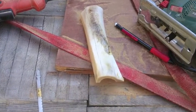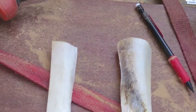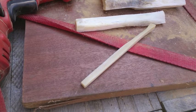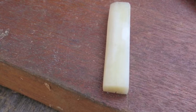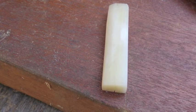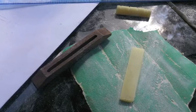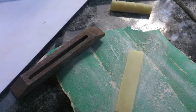While that was going I started some bone work. We had some marrow bones that I'd put in the dishwasher to wash off the excess meat, and trimmed it using the hand jigsaw. It's actually really nice material to use — it smells awful but it works beautifully. A bit of advice: cut much longer than you need so you have a handle, shape the end, then just cut it off. This is going to be the nut at the top — a nice fat piece of bone — and I sanded it by hand using very small files of different shapes to file in the notches. This is the bridge saddle, and there's a bridge over there which I had spare, so I'm just flattening the saddle down.